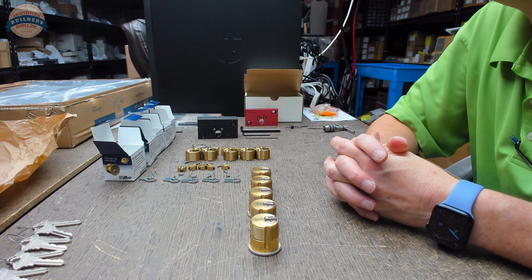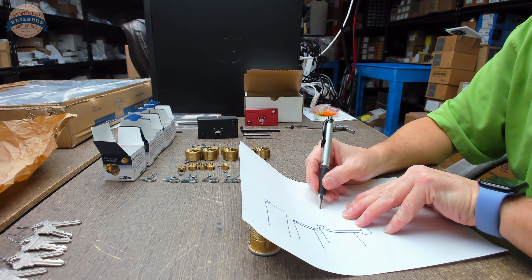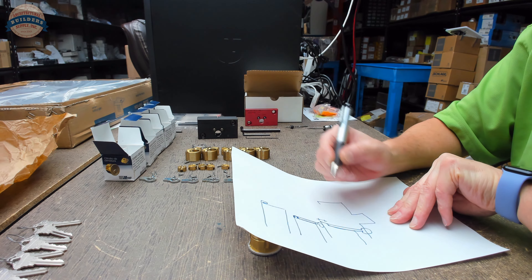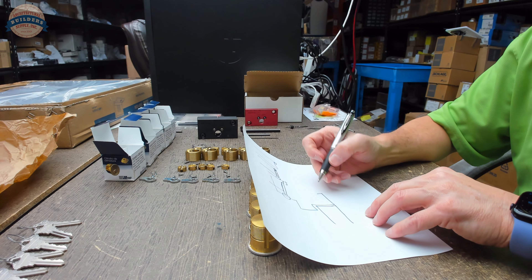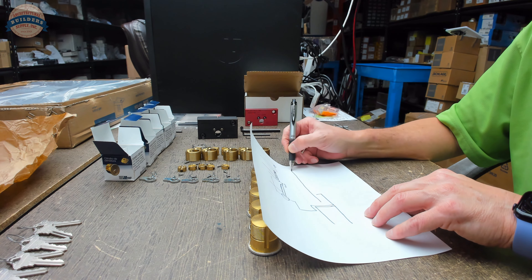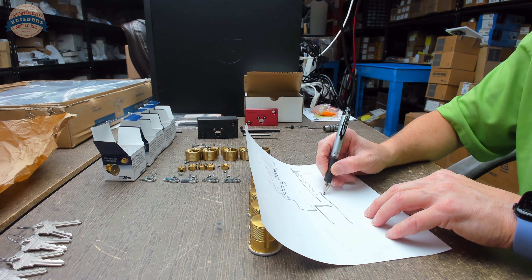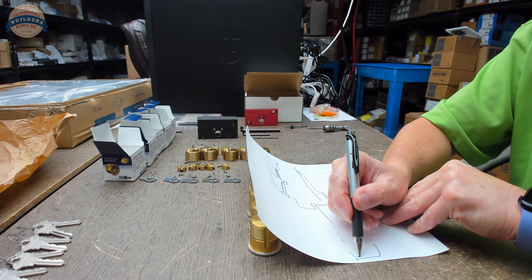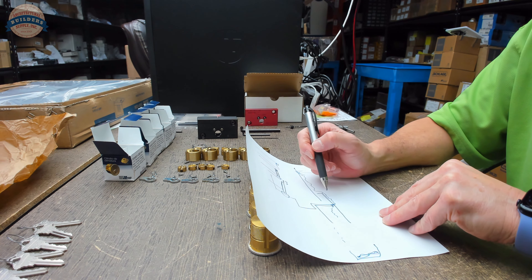About the flush top cap: that's where water gets in. Water comes down the wall, gets in at the top of the door, and runs all the way down until it gets to the bottom where it pools and collects. So when you see rusted doors, you see them rusted at the bottom — but that's not where the water came from. It came from up at the top.